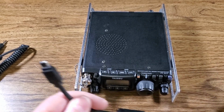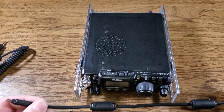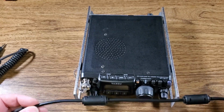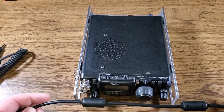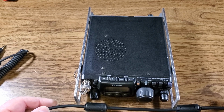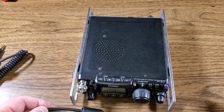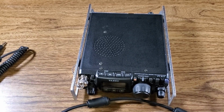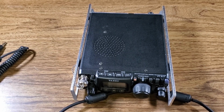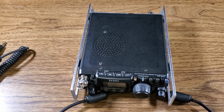Additionally, you can order a long coiled USB-C to USB, I think that's type A, cable, or this shorter one with ferrite beads on it. Originally, I did order the longer coiled cable, but I found it was very susceptible to picking up RF when I was transmitting in digital modes, which is a full duty cycle mode. So the FT-817 was basically going out at full 5-watt power, and that was causing the Digirig to drop connection to the computer, therefore requiring a complete reset of the thing.